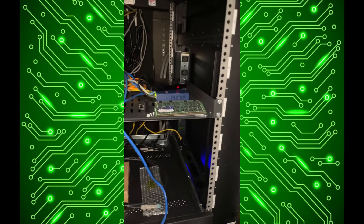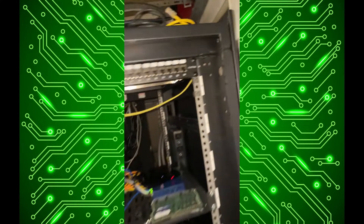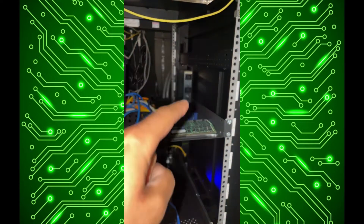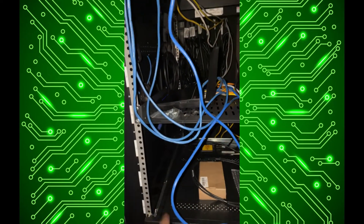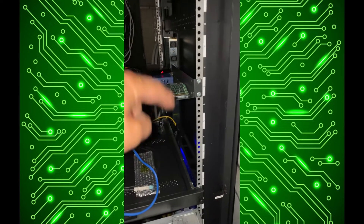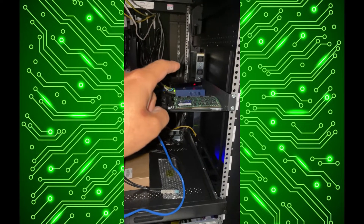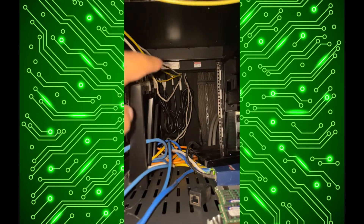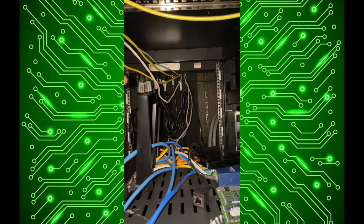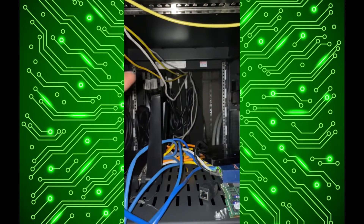I see a lot of guys spending like a couple hundred bucks on PDUs and stuff, but I went down to an office building and picked up this 36U rack for free. It came with a PDU for 240 volt, and there's another PDU — I think I put it down low — so I have one up high and one down low. You can kind of see the big thick gray cables back there, there's two of those. Basically you get 30 amps per PDU.